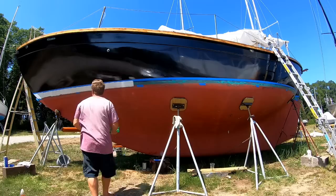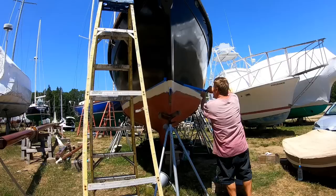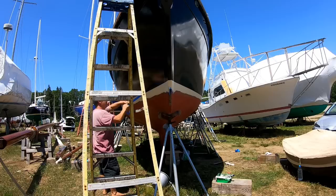As previously, I'm still using a hard anti-fouling for the boot top. I find if you use topside paint for the boot top, because it's getting dunked in the water so frequently, the paint will usually start to blister up. The only white anti-fouling I could find was Pettit Vivid paint, so that's what I'm using here.